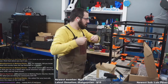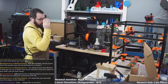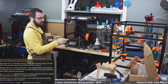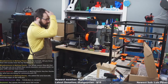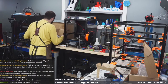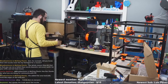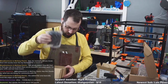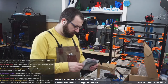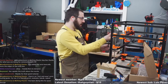It's gonna be interesting. So what I'm gonna do is actually run one. I'm gonna put my drag chains in and see if I have enough. Because right now, the fact that I've got wiring that's too short under the hood, a panel that doesn't fit, isn't leaving me with massive confidence that the wire that they have there is long enough. Now, I'm gonna put a connector in there. I'm not just gonna have single wire runs go all the way from the fan. You need to disconnect it at some point. So I'm gonna dig out my drag chains. And we're gonna install the drag chains and see how much room we have to play with. So this is, well, the bed's got enough, luckily.